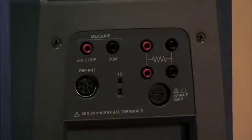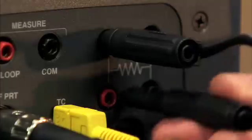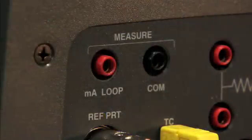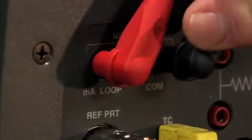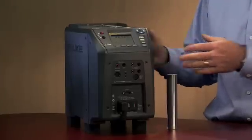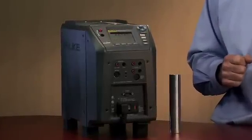You can also read, using these buttons, a 2, 3, or 4-wire RTD. With our milliamp measurement you can measure a 4 to 20 milliamp transmitter and also source loop current through that transmitter. So the process electronics essentially give you a two-channel thermometer readout in one instrument, reducing the number of tools you need to take into the field.